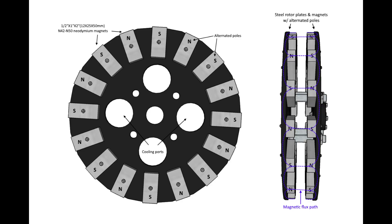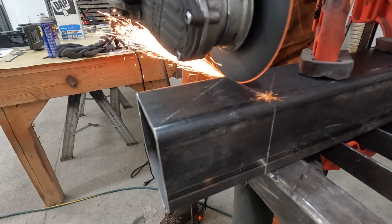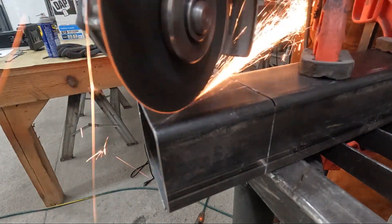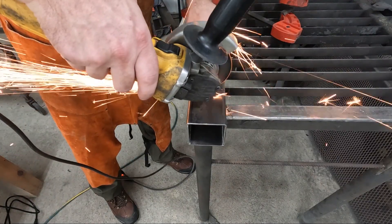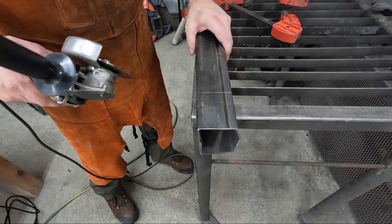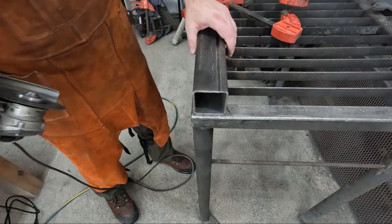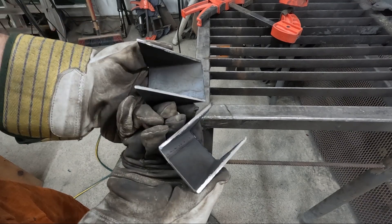The iron that would normally be in the stator is moved to the magnet rotors instead to help direct the magnetic flux into the coils, and because of this the stator needs to be as thin as possible to decrease the air gap between the magnet rotors and maximize flux density in the coils. They're sometimes called pancake generators because they're so thin, but this compact design calls for a specific size and shape for the coils to fit in the stator without making it too wide or compromising power, which takes careful planning and a robust winder.